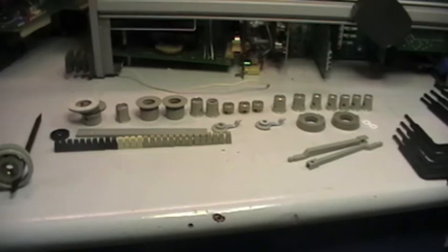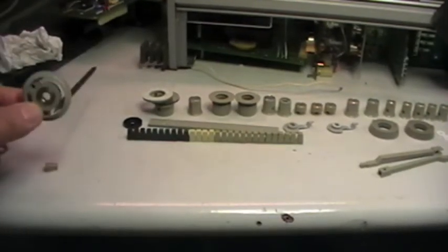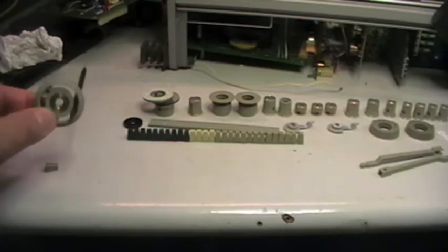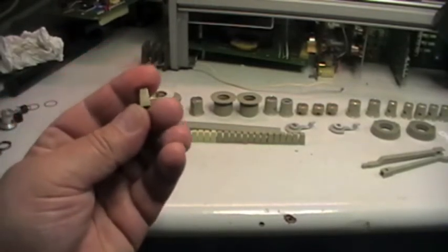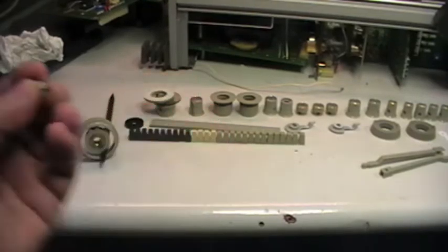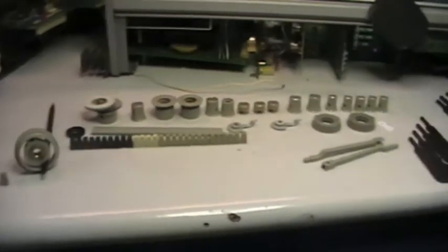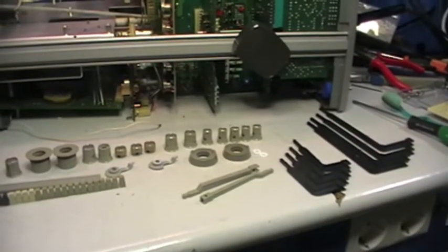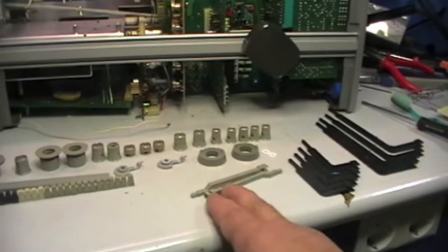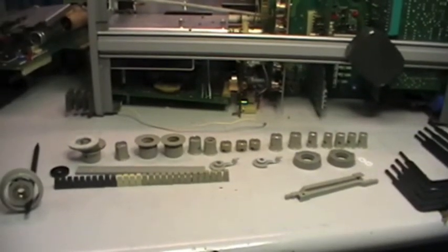All the buttons and knobs are cleaned now, and this is the way that I have cured the broken knob. It was broken in 4 pieces actually, and I found also another push button broken that I have glued with super glue, and I will polish later when it is completely dry. I also have washed some of the push button connection rods, and so it's time to clean the front panel and see how it looks.